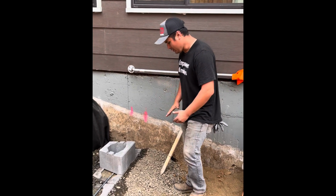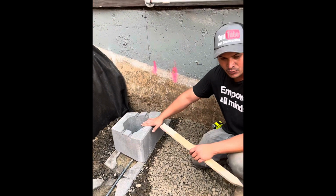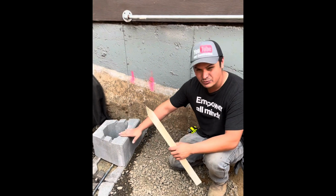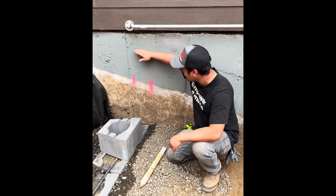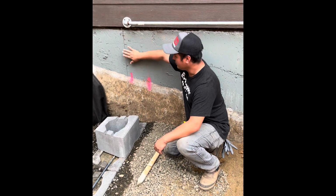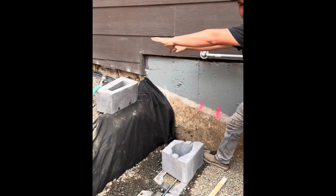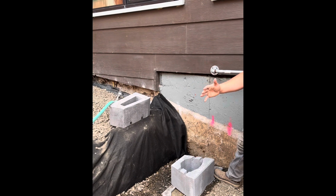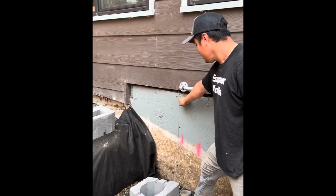So right now, what we did is we figured out our wall. In this case, we used the Murata retaining wall block from Western Interlock. We figured out our levels, so we marked our level here. After marking this, because we're gonna have a paver patio in this area, we wanted everything to slope this way. So we marked our lines where we're gonna lay our block, and then our cap here.